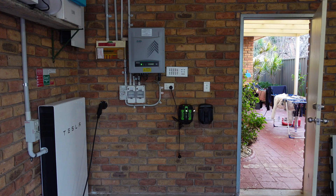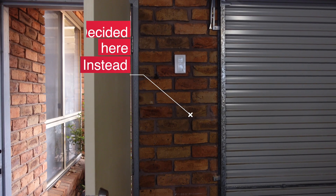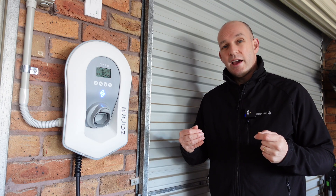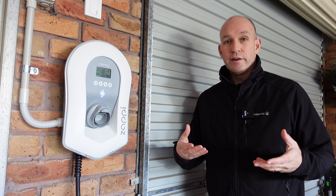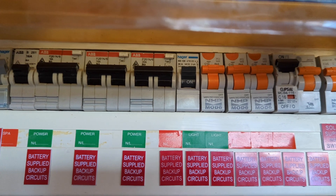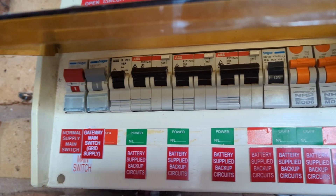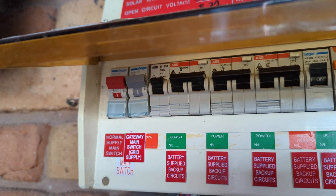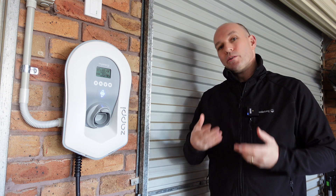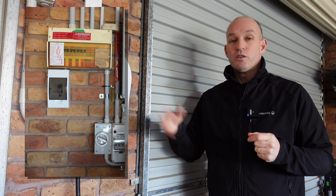To get this project started, all I needed to do was send some photographs and basic measurements to Evolution Australia. They then went to their preferred electrician who does the installations and brought back a price — originally around $750. But we didn't have enough space on our fuse box to have a 32-amp fuse there, so we had to have an additional box installed underneath it to make the Zappi work at its fastest capability through a single phase.